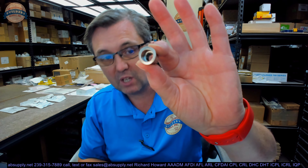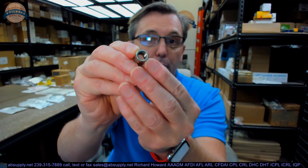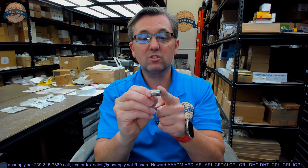This rivnut is the type of fastener where you do the following: you drill a hole, you put that into the hole, you run your 3/8 bolt, and you'll see the threads are deep down into the well. They come up right through the back, and when you tighten the bolt, it's going to force the backside to come to the front side. It's going to crush in, allowing you to sandwich that over the wall thickness of the material that you're drilling through. That's how a rivnut works.